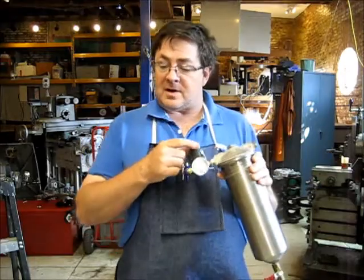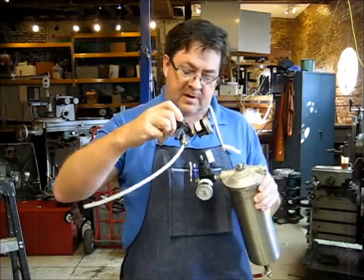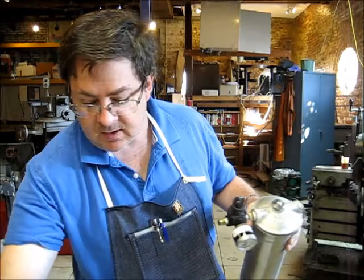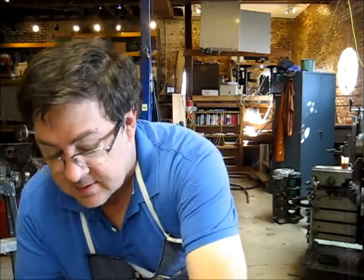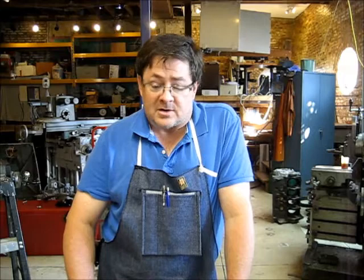Going to need some air pressure regulators, small ones. The benefit of this design is that it pressurizes the coolant at equal rate to the air, so you don't get the spray fog that will fill your shop up and turn your shop into a choking, man killer of a work site. I'm one of the people that reacts very poorly to the misting style coolant. I've had asthma and allergies most of my life, and it doesn't do well with me.